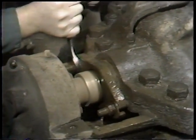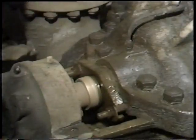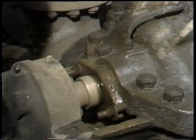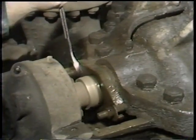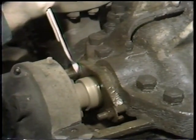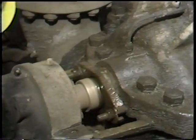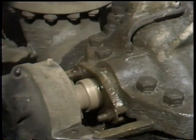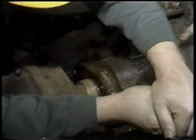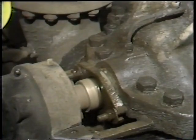The workman takes up very gradually on the two packing nuts, using care to take up an equal amount on each one, while monitoring the amount of leak-off and watching for any indications of packing overheating. When a small amount of steam comes out of the packing — an indication of overheating — the workman immediately loosens the packing adjusting nuts. These adjusting steps must be repeated over a period of time, sometimes hours, sometimes days depending on the pump, until the packing is finally seated in the stuffing box and sealing properly.